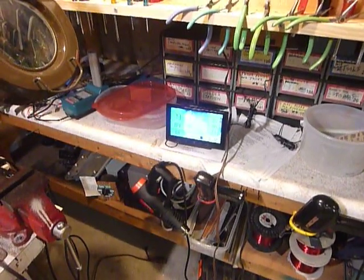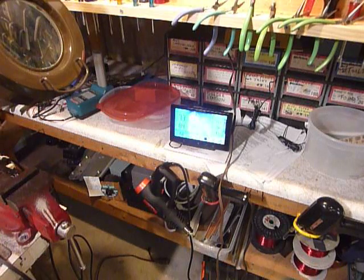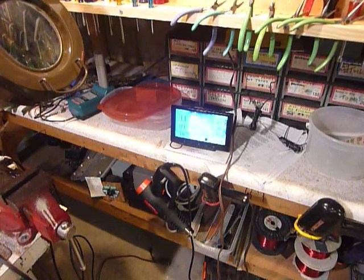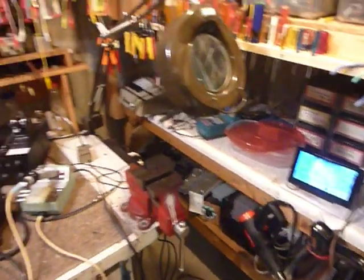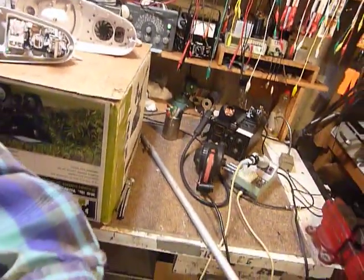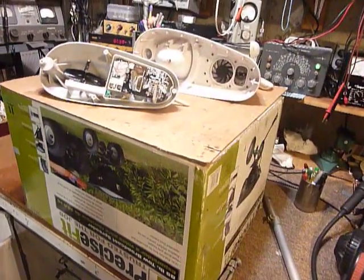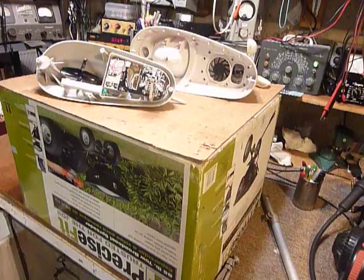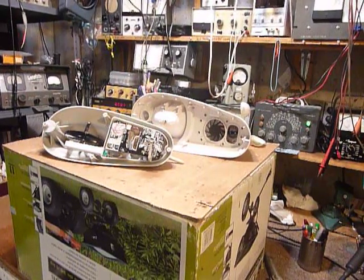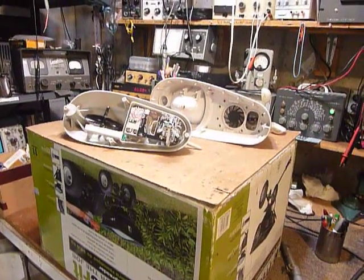And I've got the other part right over here, sitting right there so that I can keep track. I looked over at it after I was working on that, and after it had set for 4 hours with a little fan blowing on it, I found out, hey, it's operating just like it should, because the numbers all came on, the temperature and everything. Then I flipped around the wind direction indicator vane on the weather station itself, and by golly, it changed. Now that updates like every 3 minutes or something. So I gotta tell you, if you're working on one of these, don't expect readings to go changing zip, zip, zip on the screen, because they won't. They'll blink and change like every 3 minutes. So you got to wait for it.